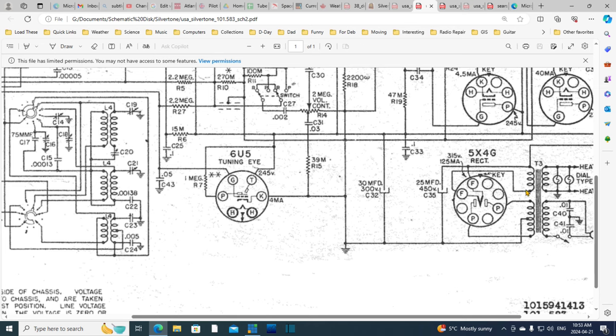Where would the voltage be dropping, if you pull harder and harder and harder on this? Yeah, you know what? That's not going to explain it, because that's not happening. It's not excess current going here. If anything, it's minimal current going here. So why is this not 315? Possible answer is this tube is old, and there's an increased voltage drop in it. So that might explain the 250 here. That would mean this tube is probably not long for this world either.